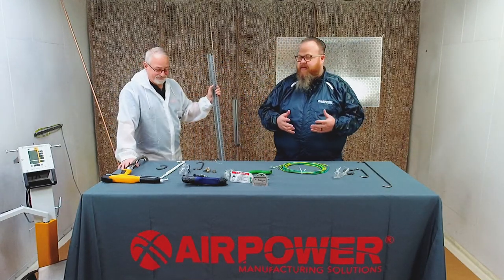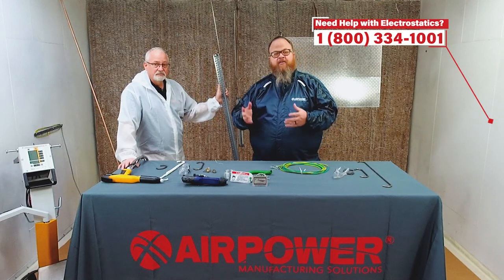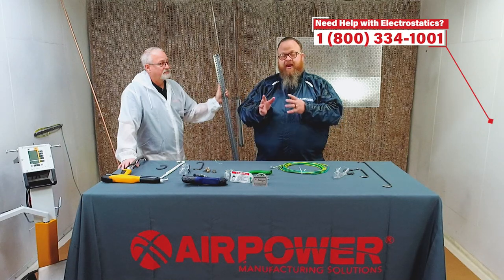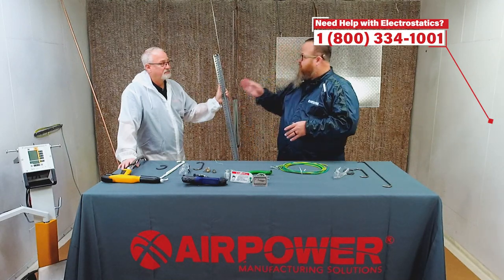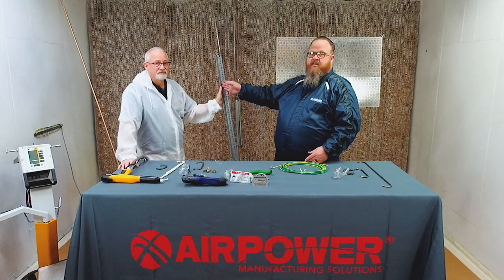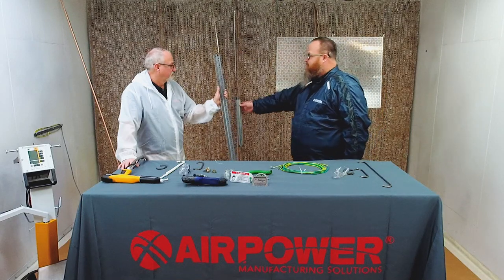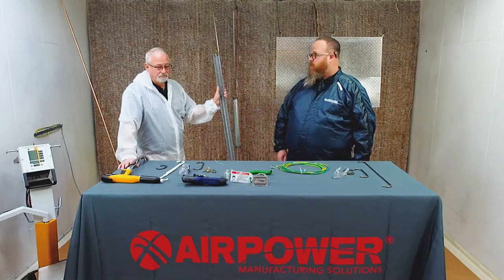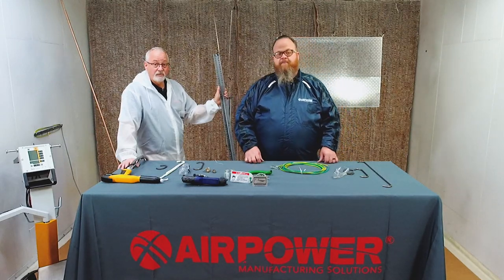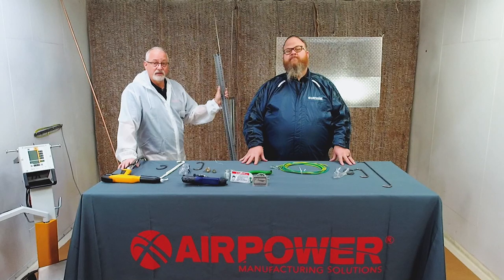In the electrostatic process for a powder gun, I've often told people this: what is a powder gun other than a powder delivery method? Anyone? It's an air hose. It blows air through that gun. So if you're trying to jam a gun up in here and you've got a high volume of air coming through here, you're just displacing the powder. You're just blowing it straight out. That goes for anything. If you're a flat piece, a bar stock, a round stock, or end stock, corner stock, whatever, you're going to have the same problem. Takeaway from that is lower velocity equals higher transfer efficiency, which improves your electrostatic process.